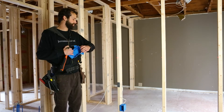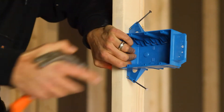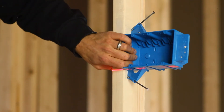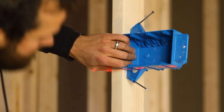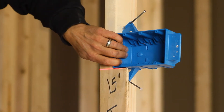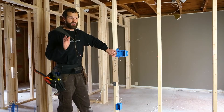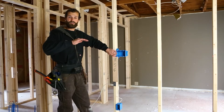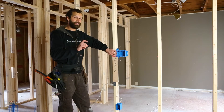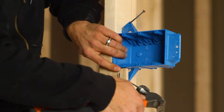For demonstration purposes, 48 inches again. I want to be mindful that half-inch spacing for drywall — the tabs are 3/8. I'm going to be using my nail-on jig. That measurement is the bottom of the box. You'll find on architectural notes that architects will typically reference the center line of the box, but that's not as practical and we do need to relate that language to the job site language for the electrical team — 45 inches to the bottom of the box.